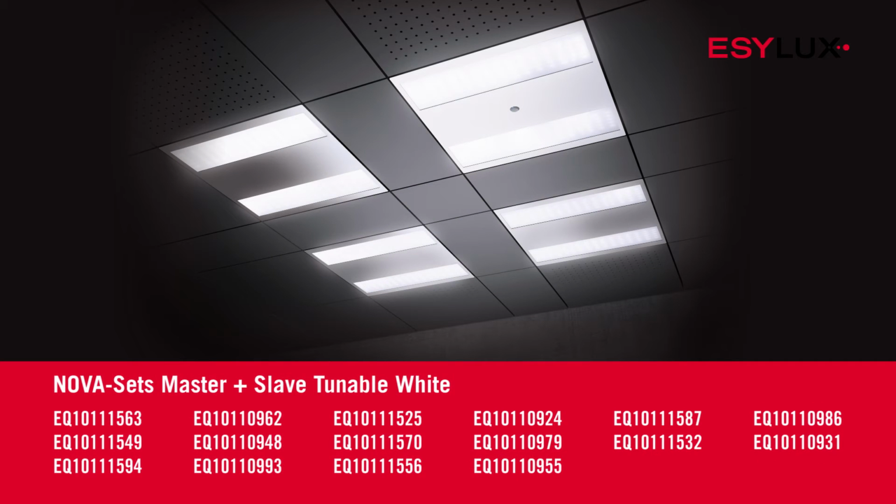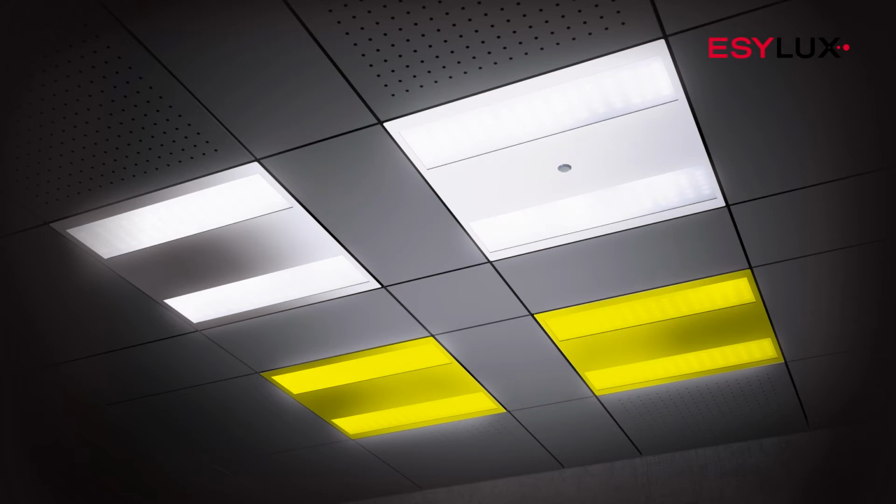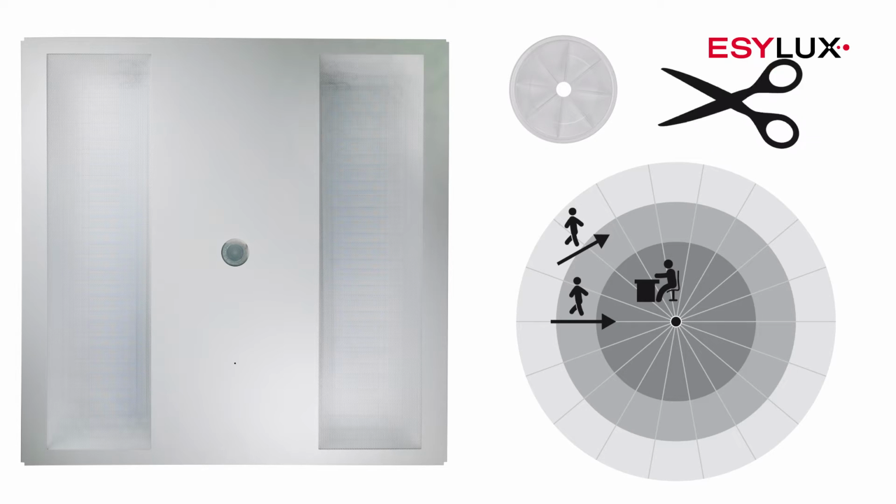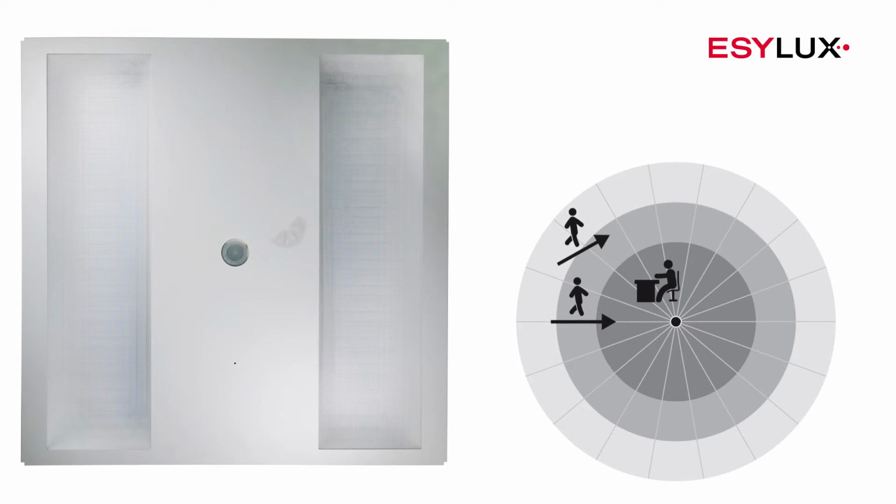The lights also come in practical sets. The master lights control slave lights, as well as DALI devices. The presence detector in the master light boasts a 360-degree field of detection. Any sections of the field of detection that should not be monitored can be specifically masked off using the lens mask. Simply crop the lens mask as required.